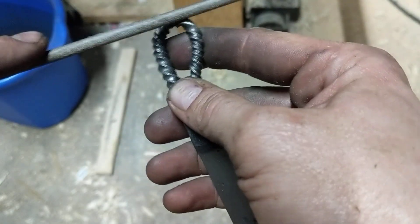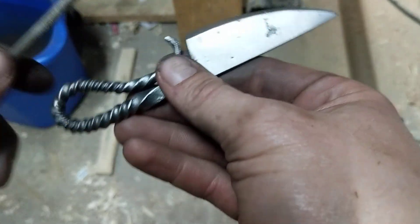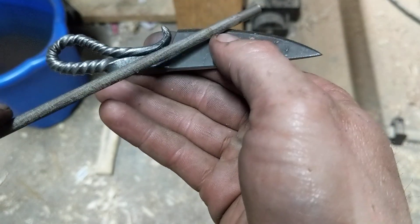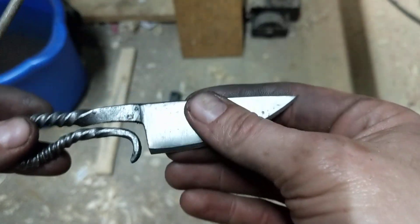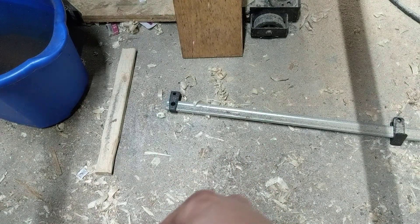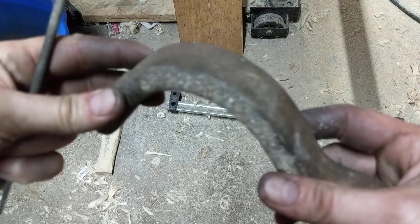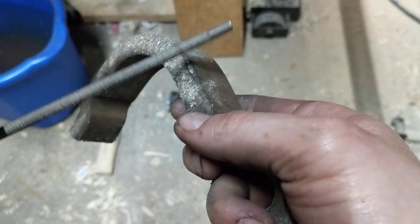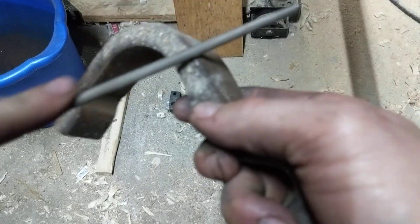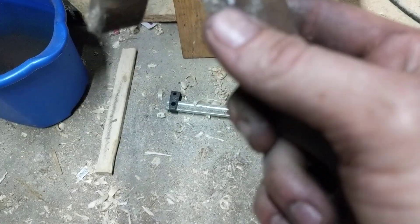It does dig in a little bit here on the tail — obviously I didn't quench the tail — but case in point, it's still the same bar of steel and this end took a fantastic hardness. Couldn't be happier with that. By comparison, just so you don't accuse me of having a dull file, here's a piece of railroad track spring clip. These are 1065, which is a high carbon steel — I've analyzed these myself. You can definitely hear the difference. These are tempered way back to be a spring, so they're not terribly hard and they take a lot of shock.